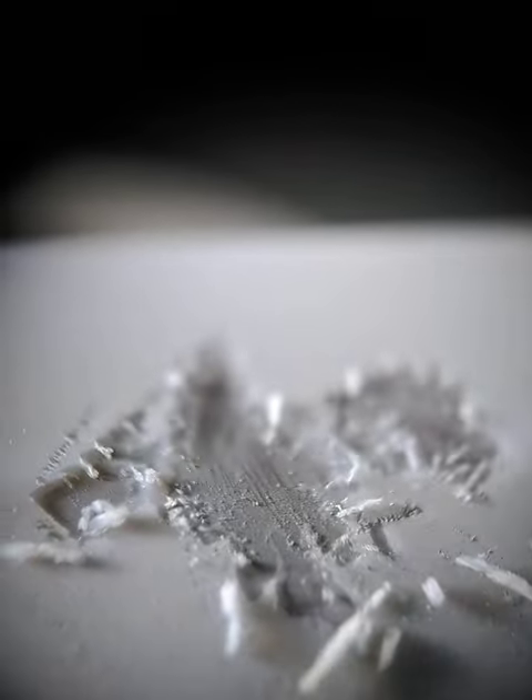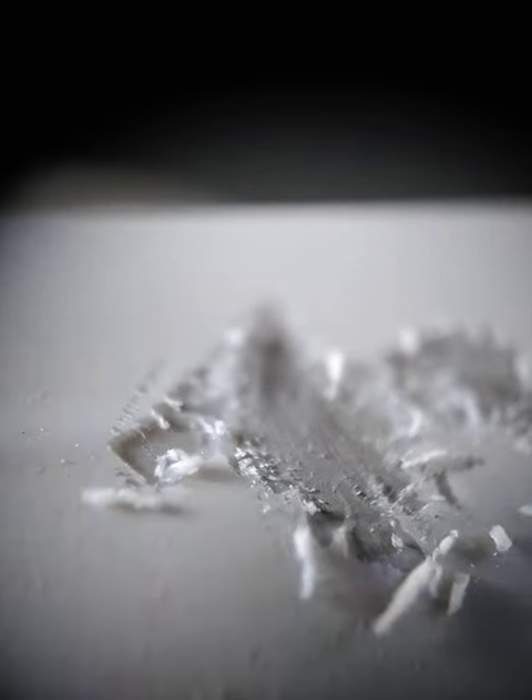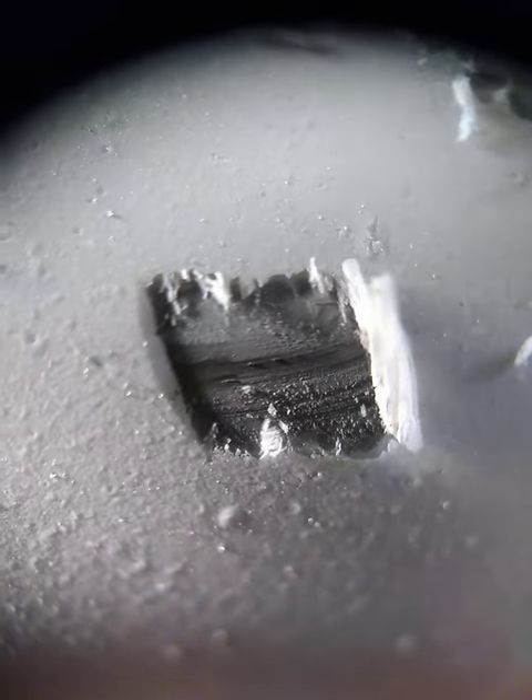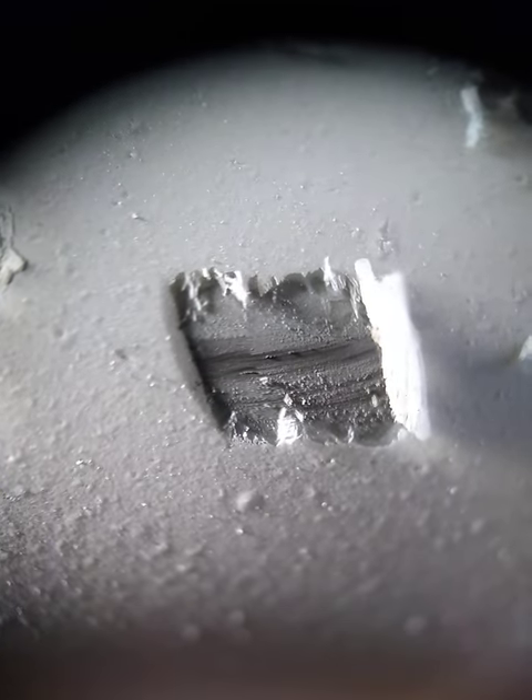Here I have been laying down the anode stem, and now this surface is damaged. You can see that it is a kind of dusty stuff. Maybe I can show it in real life — I will take scissors. It's like dust. This is made with a scissor just scraping off. So this whole arcing stuff made a fluffy dust, and now it sits on the anode stem.